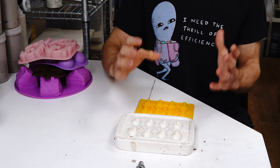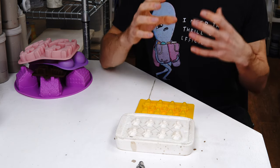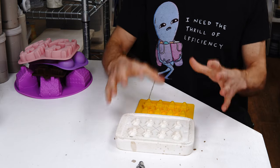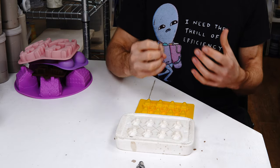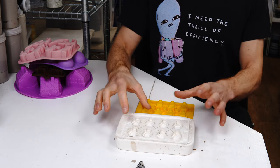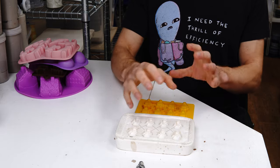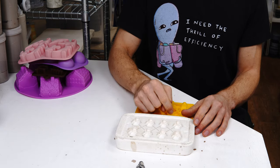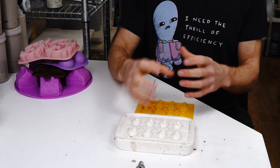I love slip casting — I think it's great for certain applications. But I hate working with plaster, and I really hate trying to make a mould from a physical solid object by pouring plaster over it. The properties that make plaster fantastic for a detailed mould are exactly the properties that work against you when casting a solid object. It gets into all the details, sets really hard, is very brittle, keeps its shape, and gets into all of the cracks — which is a problem if the object you've put into it is also very solid, because you can't get the two apart. They bind together and it's very difficult to separate them.